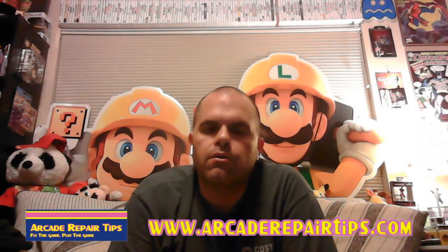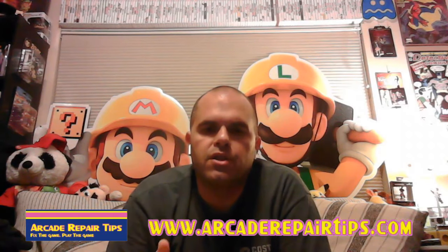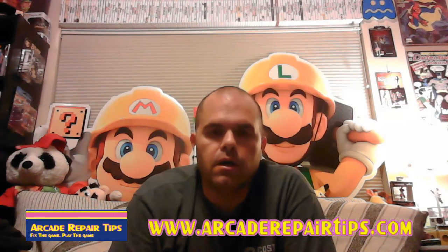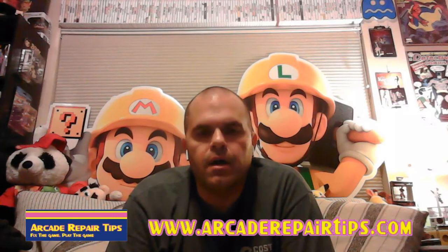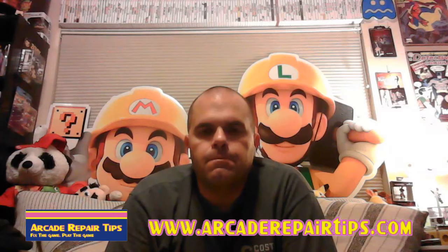Usually the only thing in a monitor that can click would be a relay. If you have a chattering relay, that can be caused by low or what we call dirty voltage. And usually that can be solved by replacing some caps around the power supply section. I have seen them do that if something is shorted on the secondary side of it.